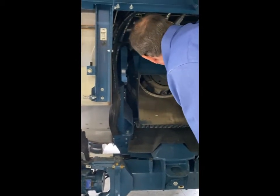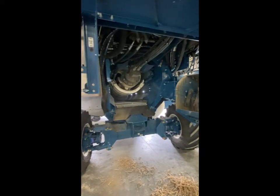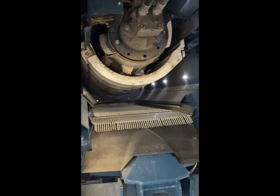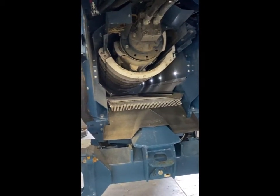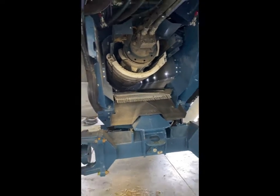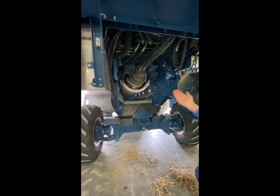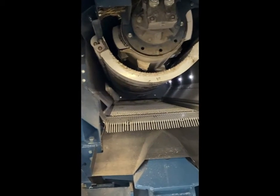Inside, we have a deflector — if you don't get the chopper, that's what the back of the combine will look like. Everything's on a rail system, so we can pull it out for accessibility to the interior. The combine itself has five individual concaves that also slide out on a rail. There's a two-speed drive for the rotor, which is over 100 inches long and made by Elmaco — running 0–600 and 600–1200 RPM. All the concaves are laser-marked with the distance between the rods, and blanks are available for easy crop switching.